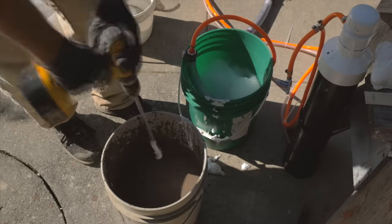These new panels did very well in the durability test. There was little damage to the surface. The perlite didn't make much difference in this case and didn't increase the durability. Without a hard aggregate in the mix, this form of concrete is always going to be weaker. The trick is to find the right weight to strength balance for your application. The panels were very close in weight and averaged 56% lighter than regular concrete. This denser aircrete has a very good finish and it fared much better than the previous ones in the durability line trimmer test. There's some damage, but it looks minimal, and it looks to be the same in the panel with the perlite added.